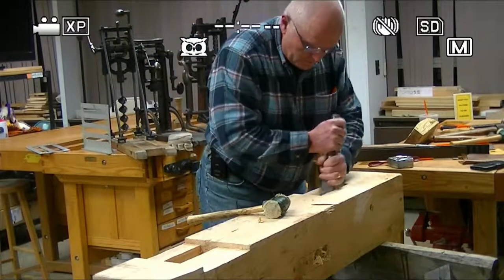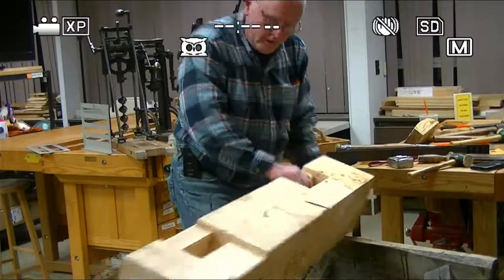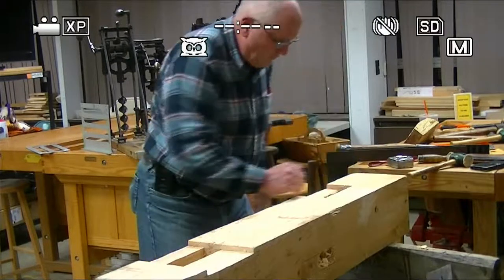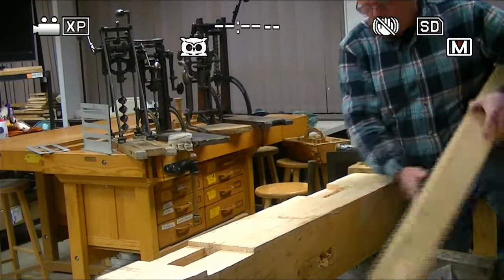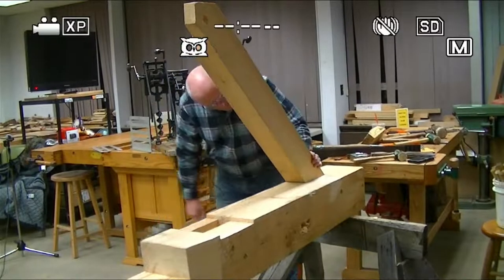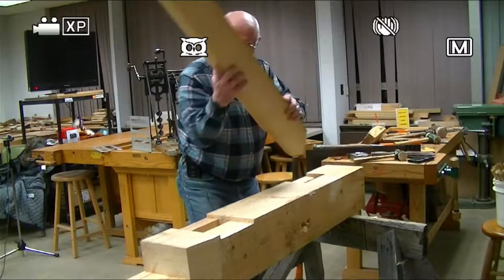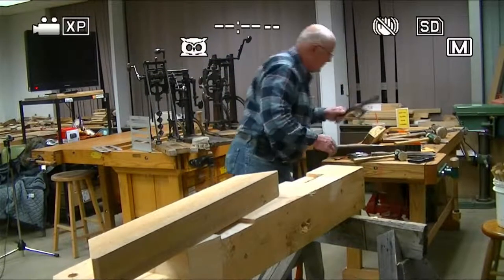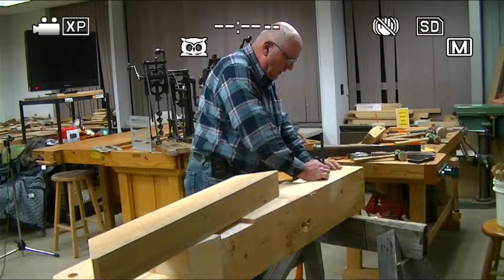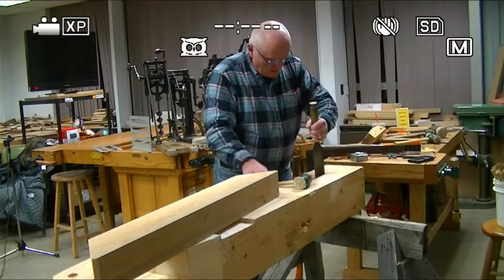The piece coming out of this mortise is on a 45-degree angle, so I need to remove the shoulder so it's not interfering with my brace. Let's get this stuff out of here and do a little test fit. I'm going to take my brace, slide it down in, and it fits. Nice and good lines there, my angle is out of the way. I'm noticing I need to make sure this shoulder is plumb — it's not, this corner is a little too far out. This face should be sitting tight against this and it's not, so I need to clear a little bit more in the back side here.